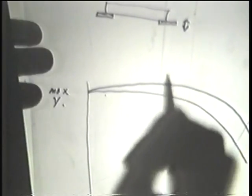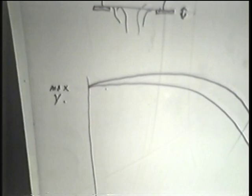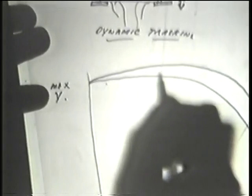It does the opposite. So there are obviously control wires that go to the head, and a circuit which will control the height of this head while it's rotating like crazy. And it will track the line of magnetic material that it's supposed to dynamically. It's called dynamic tracking. Now, that feature makes for really perfect reproduction of whatever's on that tape. Perfect interchangeability. If you play back on a tape recorded on the same machine, you get almost perfect playback. The problem lies with somebody else's machine that is not quite as perfect as yours, and then we have problems. Well, this thing will compensate for that and follow it, so you get perfectly clean pictures at all times.